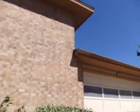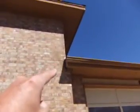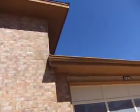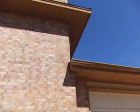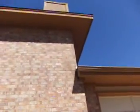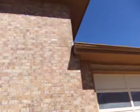And then here, adjoining garage, you can see here we've got a big hole, again like the one around the corner. This one is not going into the garage though, this is going into your house. So there's water been penetrating, almost guaranteed water's gone into that wall there. This reinforces my call for a mould inspection, because I don't want you moving into a house that has mould. And I've got too many telltale signs. It's costly, I know, but it's well worth the money, to have it inspected to establish whether it has or has not got mould.